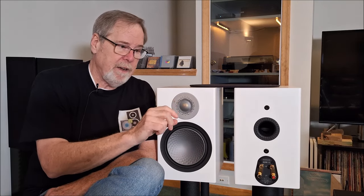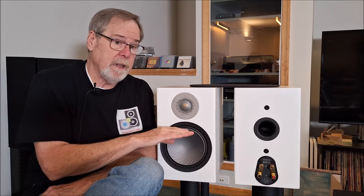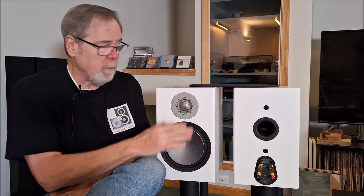Pairing it to the Evo 150 was a great combination, but with a caveat. The Evo 150 uses a Hypex N-Core amp module, which does have a little extra energy on the top end, and combined with this speaker it's a little much. So I had to go in and use the Locus EQ to bring everything down a half dB here and there — I talk about that in my video about EQ. But doing a little tweak with the Locus, the Evo was great with this: great image, great soundstage, great bass. Literally half a dB or a dB at the most. Magic.